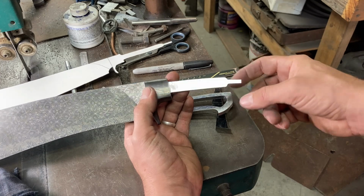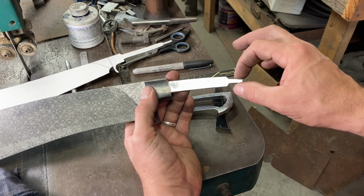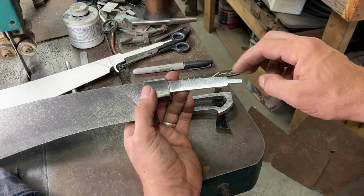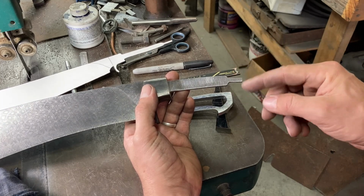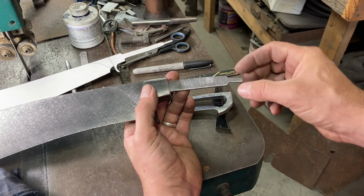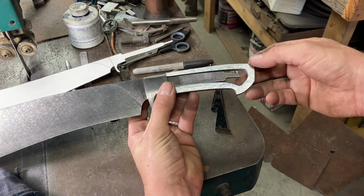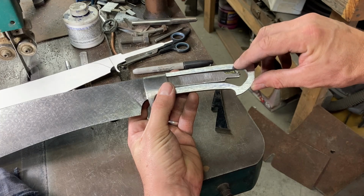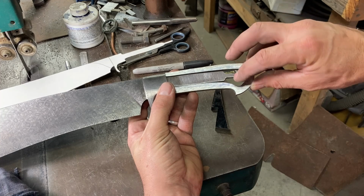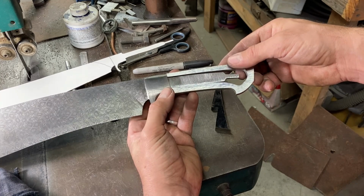That'll be all right in this direction, and then from this direction we'll take it right down to about 190. Then we'll turn it octagonal, and then we will carefully smooth it up round, chamfer the very end, and then we're going to go ahead and use a die and thread this. And then we'll come back and check, and we'll start marking out and making the block that this fits up through, that then locks into this and then pulls the whole frame tight against the back of the bolster.